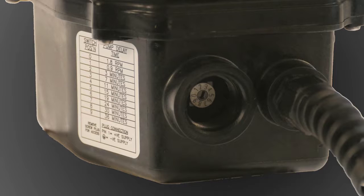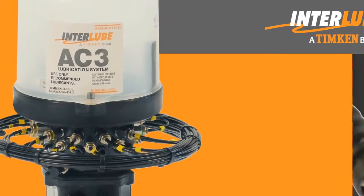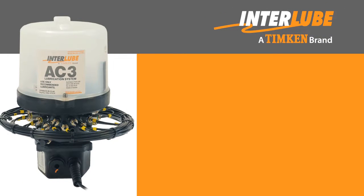The timer setting on the pump is preset from the factory to automatically grease the entire system every 30 minutes when the ignition is on. Although the timer setting is adjustable, the 30-minute interval has proven to be a reliable setting and generally does not have to be changed.